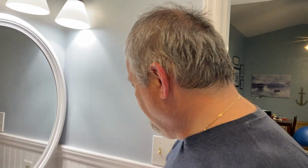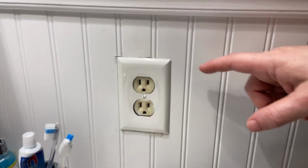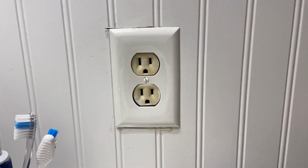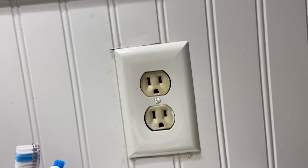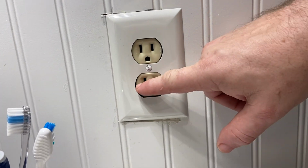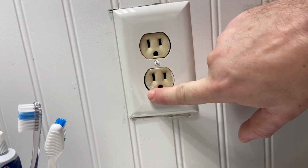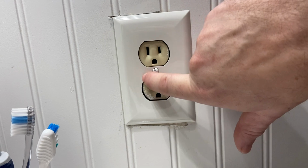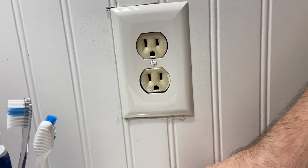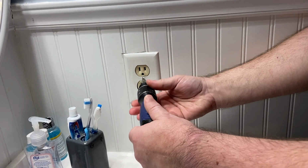And that is related to electrical work. And here is a receptacle. We'll try to give you a close-up, but as you can see, it is very poorly adjusted. First of all, the box was too big. Secondly, you can see this is not correctly fitted, the plate is not flush, right? It should be flush. So let's remove it and see what we can see.